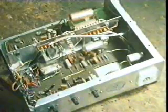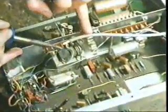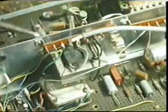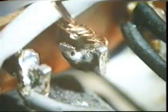In electronics, components are often soldered together. Here, the heat is supplied from a copper bit which is heated electrically. In this case, the flux used is one that is not corrosive. Why not corrosive? The flux is contained in the cores which run through the whole length of the solder.